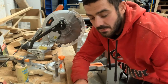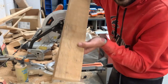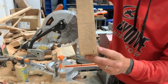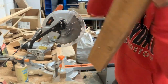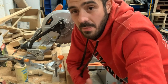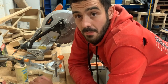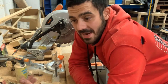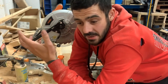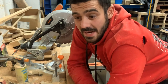For leg construction, we need to take out a section here and also here - this is for the two long pieces we've just cut to slot in over the length of the table. We also need to take a section on the end for a crossbar to go across the bottom. Because this is going to be a flip top table, we're not going to put a permanently fixed crossbar on top. For now I'll just put a piece of wood in and screw it from either side - it's not a brilliant permanent solution, but we need something we can get back out easily because we're going to be putting a separate flip top in there at a later date. No point cutting joints since we'd then have a piece of wood missing from the frame when we go to put the flip top in. Screws through the end will be perfectly sufficient.